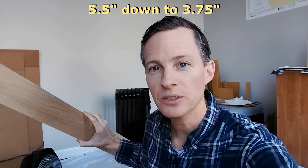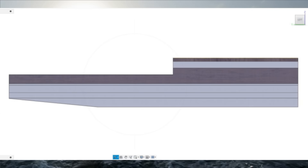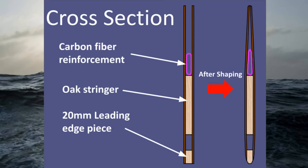We've got the space heaters going in the workshop and we're going to make version 2 of the rudder using a different method — we can call it Perry's method. I've ripped the oak stringer down from 140 millimeters to 95 millimeters and cut a 20 millimeter wide piece of oak for the leading edge. As you can see in the 3D model, I'm going to glue the oak stringer 30% of the way back from the leading edge, then the leading edge piece goes along the leading edge. I'll sandwich the plywood around the two oak pieces, let them glue flat, then clamp the trailing edge together to make the foiling shape on the aft end, and shape the forward section with a router and sanding.